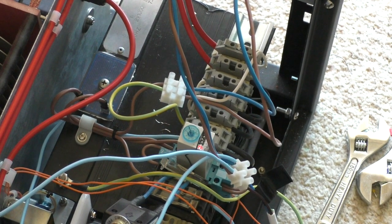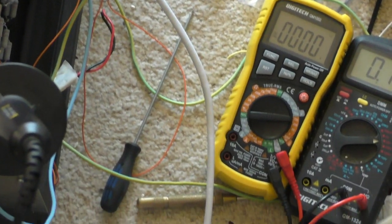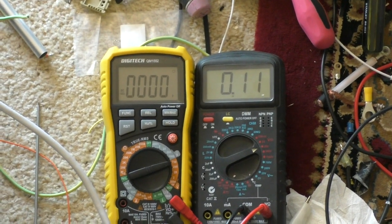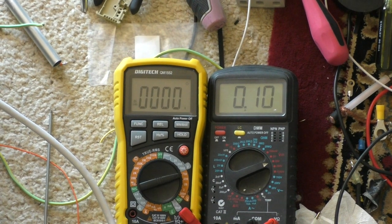What I want is to be able to plug it into the mains — I've got a variac on it at the moment — with no risk whatsoever of the HT rail going well above a level that might cause the valve or the capacitor bank some angst. This works an absolute charm. As explained in the previous video, the little transformer's secondary is in series with the primary of the main HT transformer. The meter on the right shows HT in kilovolts and the one on the left shows the AC mains voltage.